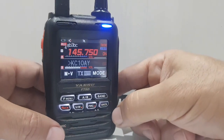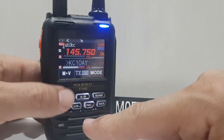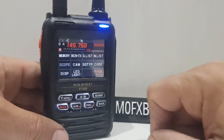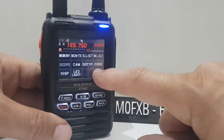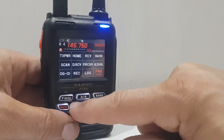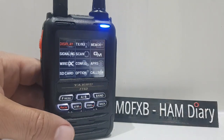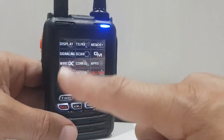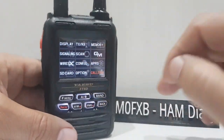So I'm still learning this radio. The buttons you're going to use a lot are the back button and the F menu button — that's pretty much like a select button. With a short press you get this sub-menu: CAM feature, squelch, some functions for APRS. Go back one — another menu there: TX power. And if you hold it, you get the main menu. Similar to the FT3 — it's all there. You definitely need to get your callsign in before you do any Fusion recording. Wires X settings, SD card, group mode, scan, and signalling — like all your tones and things.